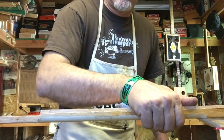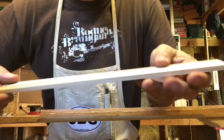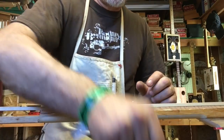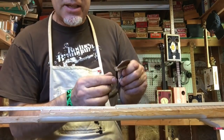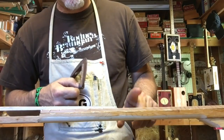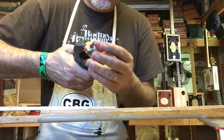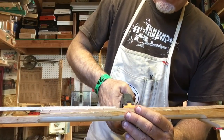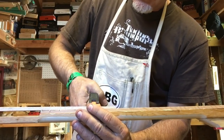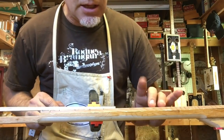We're going to squeeze this thing together. Now if you're going to use these kind of clamps, I recommend getting some sacrificial pieces and putting those over your fretboard so that when you tighten them down, any indentation from the clamps goes into the sacrificial piece of wood and not into your fretboard. You could also use lighter clamps, but again, I always recommend using the sacrificial piece just in case.